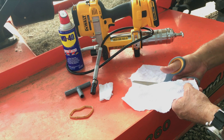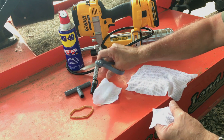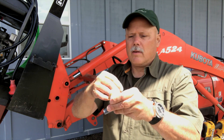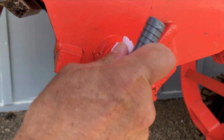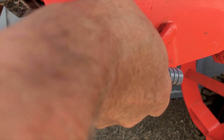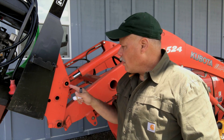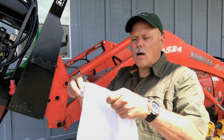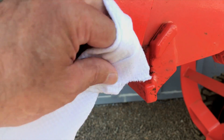I took that one step further and cut myself some patches. All you need is about a two-inch square piece of material. Just lay it over the T, then take a rubber band and wrap it so that you've got your patch material nicely held on the end of that T-fitting. Now you can go around your tractor on all of the recessed Zerk fittings, push it into the Zerk fitting, twist a couple of times, and that opening is nice and clean. If you need a little extra cleaning, just take some more cloth, lay it on top — it'll bunch up in there and clean out that recessed opening.